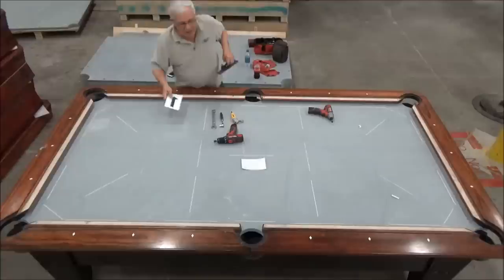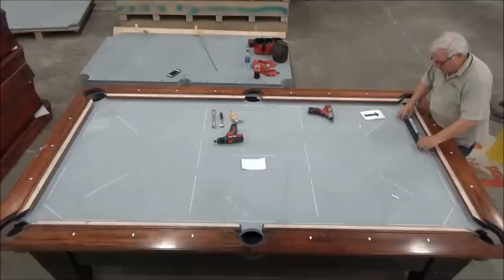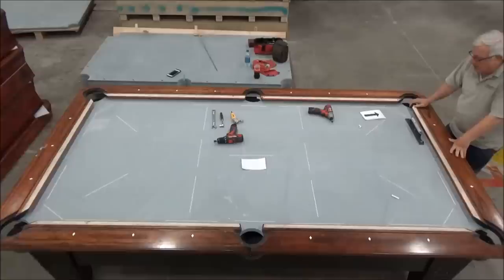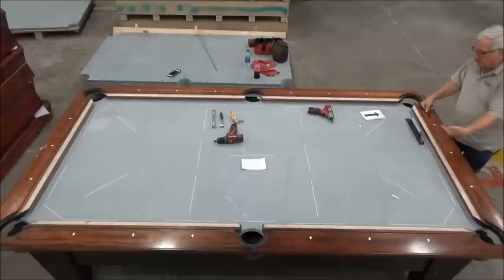And one of the goals in making the measurement is to set the level in the same position every single time, which is not really very easy to do, but I use the outline of the tube, so where you can see the glass vial. And I take the outside edge of the tube and I line it up with a diamond. And this one is reading one line low, so it's reading 5/1000ths low in this direction.